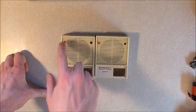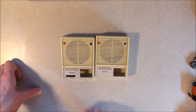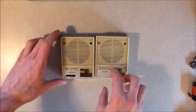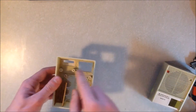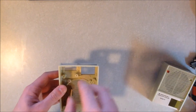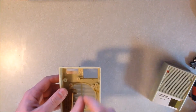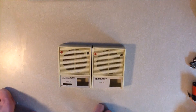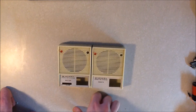It did a little more damage with the bigger hole for the toggle switches, but there will be a nut that will actually go over that to cover it up. Here's the master and here's the remote - the LED will be there and the switches will be over here. I was originally going to put the button here, but there wasn't enough space between the PC board and the case, and the potentiometer was blocking where I drilled the hole. The small push button I ordered will definitely work - I should have measured twice, cut once.